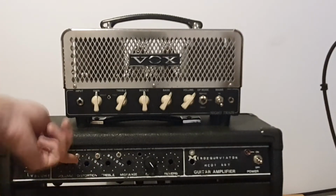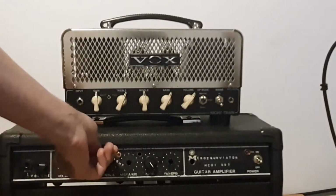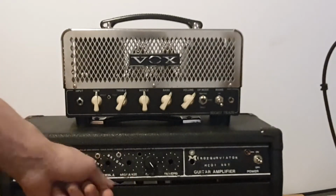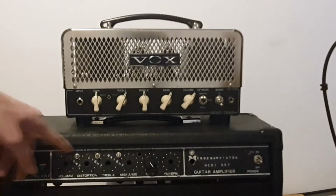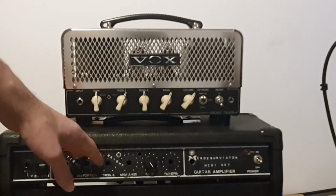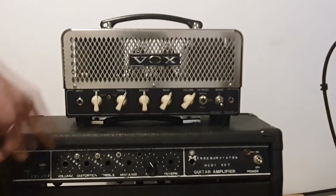I have some switches to change the bypass caps on V1 stage. This is the switch that changes the coupling cap, so this makes it like less bass, more bass, less bass, more bass, and a bright switch which takes the bright cap in and out of the circuit, and that's it. So you basically have a gain knob in this amp, because I don't touch these anymore. It's set to the bright, and the circuit is now set to the AC30 treble circuit, which I really like. And that's what I want to do with this amp.